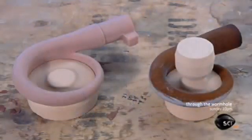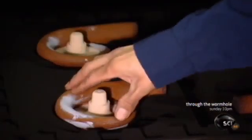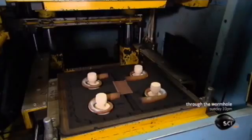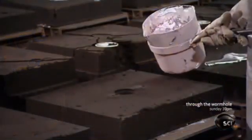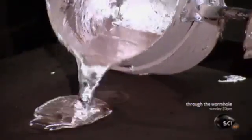These snail-shaped sand cores are now ready for casting. He places the cores in a mold, which is also made of hardened sand. Machinery lifts the bottom half of the mold to the top half, closing it. He pours molten aluminum into it and it flows into the spaces between the cores and the outer mold. The aluminum solidifies in a minute and the molds tumble onto a conveyor, revealing the cast turbocharger parts.